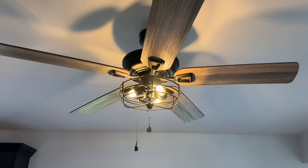We have lights on in the house and we are good to go. Right now we're running pretty much the whole house on just the generator. I did turn off a couple of things so I don't accidentally use too much power. I have a gas furnace and a gas hot water tank, so the power I use to run those systems is just the blower — not the entire system. If you have an all-electric house you might need to shut a few more things off.